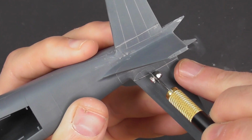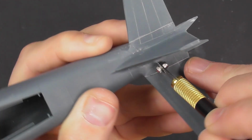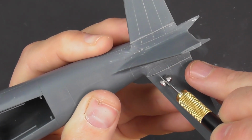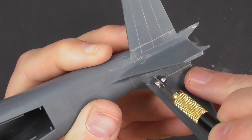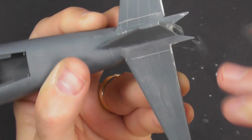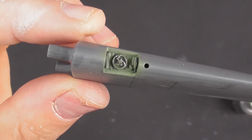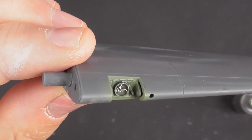And restoring the rivets. This is the Galax Riveter tool. Unfortunately, the pitch of the rivets on the kit didn't quite match any of the wheels I've got. And this was about as close as I could get. I think it was 1.25. The 1.1 didn't quite work either, so perhaps 1.15 would have been perfect.